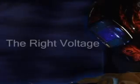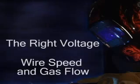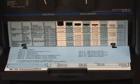When your tack welds are completed, proceed to weld using the appropriate direction to minimize distortion. Stay on the leading edge of the puddle. This is accomplished by watching the weld puddle and adjusting your travel speed accordingly. For best welding results, you need the right voltage, wire feed speed, and gas flow. Set your voltage and wire speed at the recommended setting from the parameter chart, and fine tune as you need.